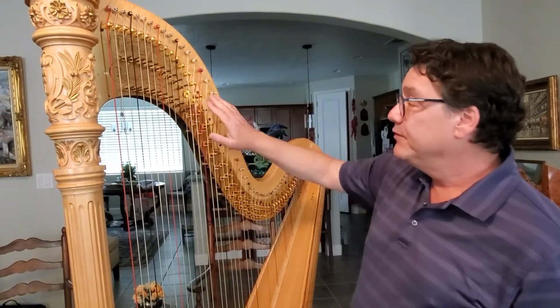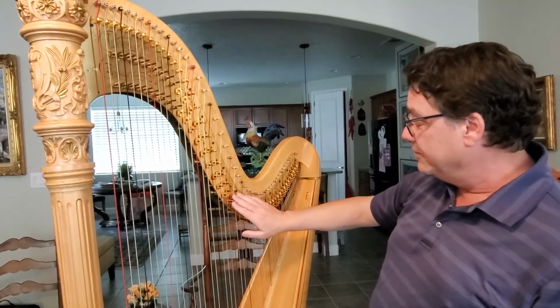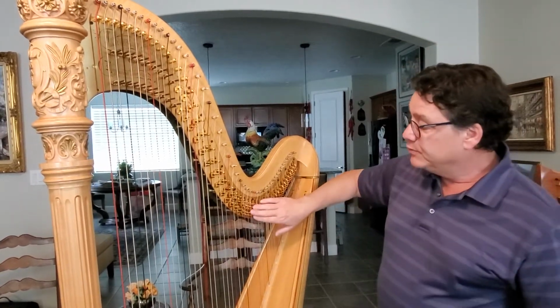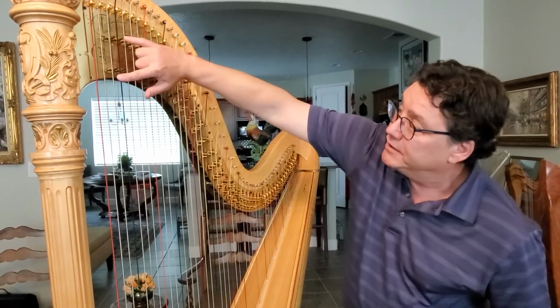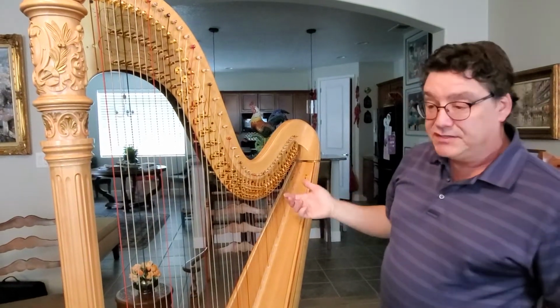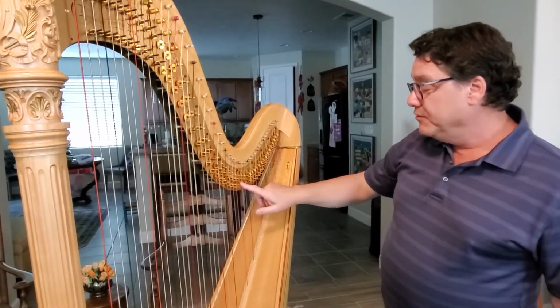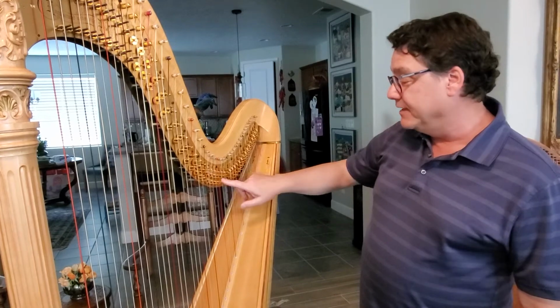So we have the oblong discs and the round discs, and they come down the fall of the harmonic curve down this way. You'll notice that the discs continually keep getting closer and closer together as they come up. That's because of the math of the change of pitch. When they get up in here, the pins, on most manufacturers, actually change sizes, they get a little bit smaller.